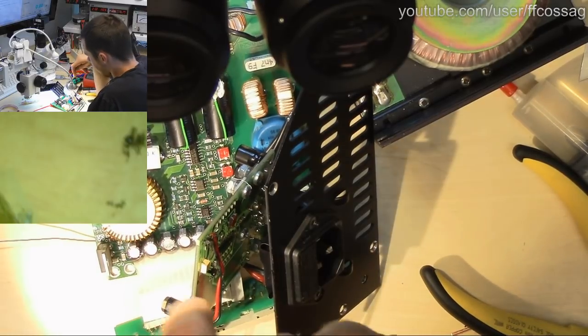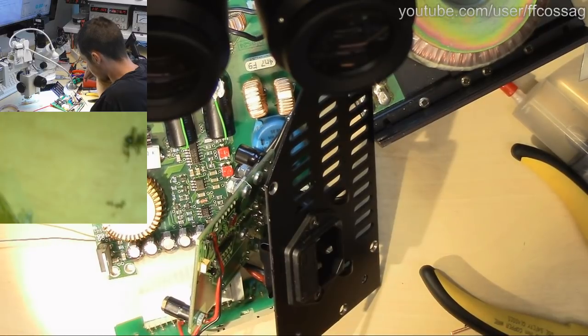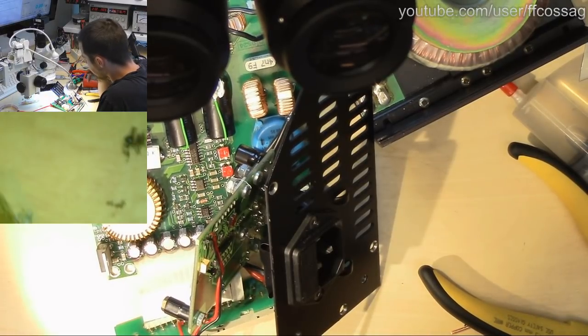It's annoying. If I had a replacement for the power on reset IC, I would install it. But I have no reason to assume that failed. The symptoms described don't really match up. The power on reset IC could potentially cause issues when it's loaded down. But I'll have to order one anyway.